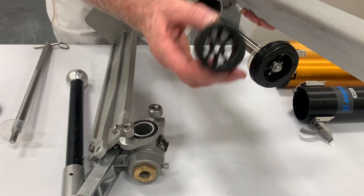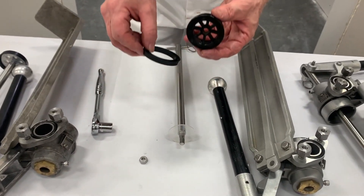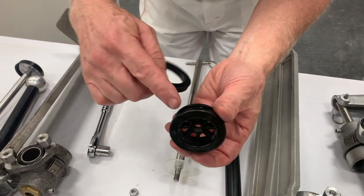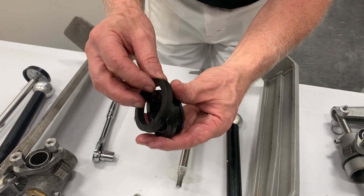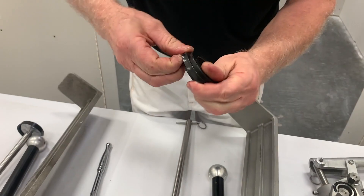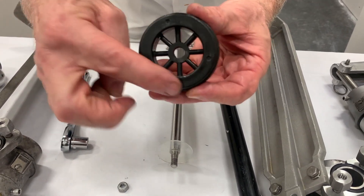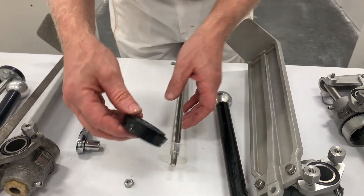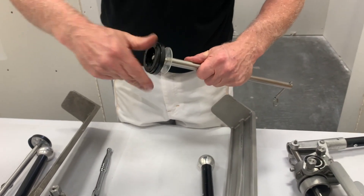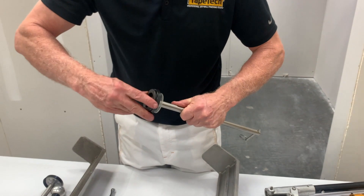You can see how it's stepped up — the larger part of this is at the bottom. Make sure you don't flip it around and have it inverted. Before installing, put the wiper on — the wiper has sides to it, so don't put it on upside down. Here's your bottom part, the wiper's cup side is open. Slide this on in this direction and pop it in place. Make sure the top side is correct and the solid hard plastic bottom is at the bottom. Then reinstall it onto the shaft, threading it on while pushing at the same time.